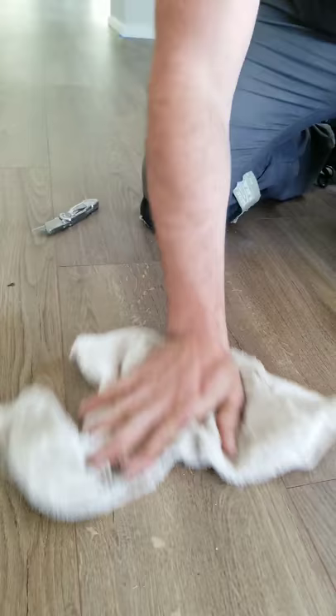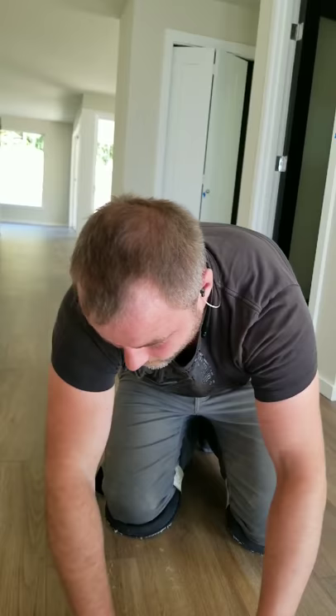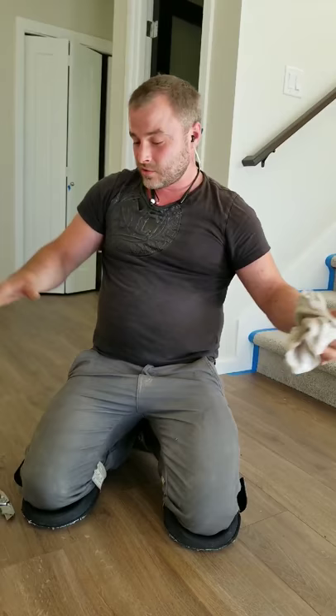As you can see it covers a lot of scratches and also gives the surface a little smoothness to protect the floor from later scratches. Easy — just wipe it and you'll see how much it covers. It's like polishing a car. Don't do just one board — go a slightly bigger area, otherwise that one board will look shinier. This is how you easily fix light scratches fast, without specific tools, before selling a house or just to make your floor look better.